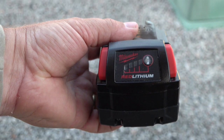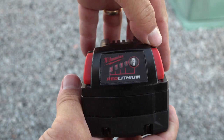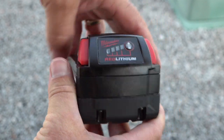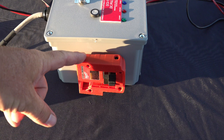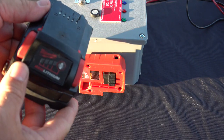The DCI-100 demonstrated in this video incorporates Milwaukee batteries. Other battery manufacturers can be used upon request as long as 18-volt batteries are available. Before inserting any battery into the DCI-100, always check them for charge. Bira recommends at least one bar of charge on the digital scale for the unit to remain operational. The battery bases are located on each side of the DCI-100. Using a Milwaukee battery, slide the battery into the base until a click is heard for a secure connection.